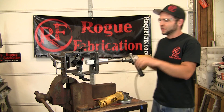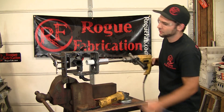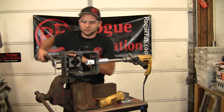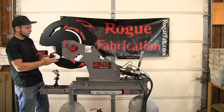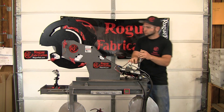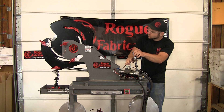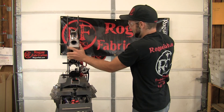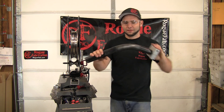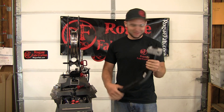This is an inch and a half hole saw and we're going to see if it will notch first. And clearly it will. We'll be bending this soon. That is surprising — that's a piece of inch and a half plastic pipe bent in a tubing bender.